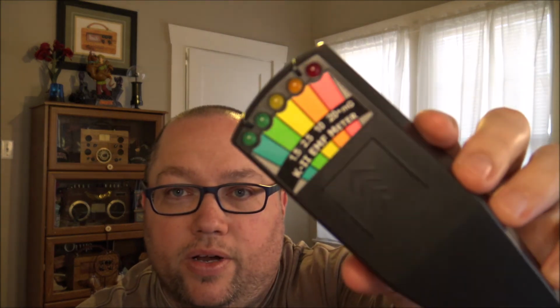I don't love this old model that you have to hold the button down, because if your finger just lightly lets up on the button, it'll flash to do a light check, and sometimes it looks like you get a false positive. Ghost hunters would push this down and shove a coin, like a nickel or dime, inside there to hold the button down, and that was how they did it back then to keep it on. Some people would drill a hole into it and put in a toggle switch, which kind of led into this next model, which is the current run K2 meter here.